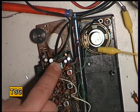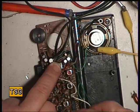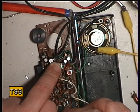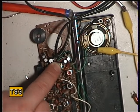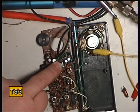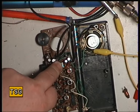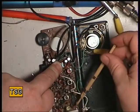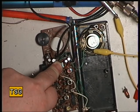I didn't think there was a detector on these, but checking now — yes, it is the detector, that one. I've put a 100 microvolt signal in. I'll just zoom out so you can see what I'm doing. The yellow one here, which is T3, right at the bottom of the set, is the detector. So we've set that up with 100 microvolts of signal.